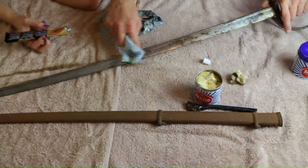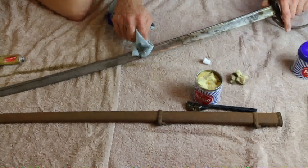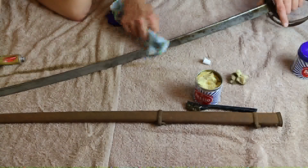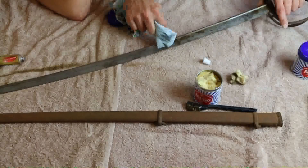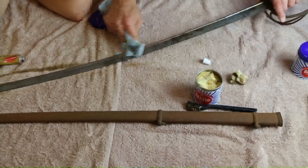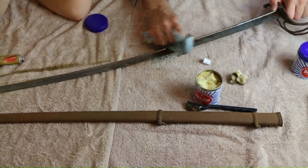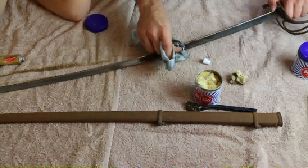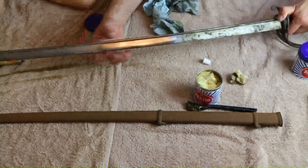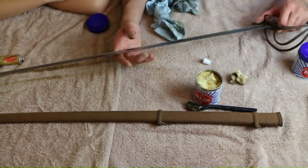With something like a sword it's sometimes difficult to do circular motions because you don't have very much width but you have a lot of length. But the problem is if you only rub in one direction you will get micro-scratches in the blade that only go in one direction. What you want is for the micro-scratches to overlay each other, and therefore they're not so visible and it looks more like true polishing. Autosol is not — look at that — that is magnificent! You can see this bit I've done with Autosol — if you picked it up it would go 'shing.'